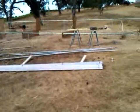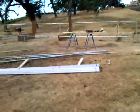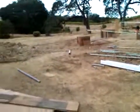The first thing I did was measure every single hole, map the whole array, and figure out how much piping I needed in each hole. You have to measure up three inches from the bottom to the bottom of the T-fittings. I created a little map on a piece of wood that shows every single hole and the length of pipe needed for each one.